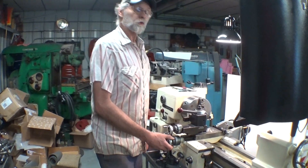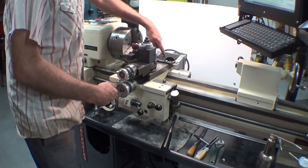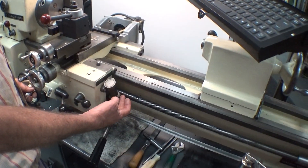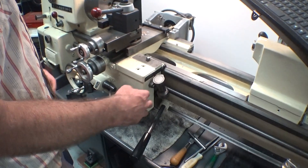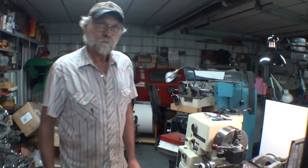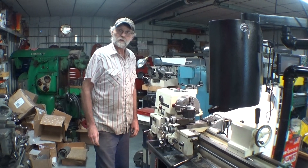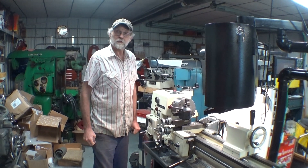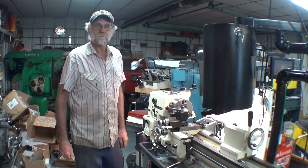When the motors are turned off, the X axis can easily be turned by hand because it's hooked right to the motor and it's a one-to-one drive. Here on the Z, since it goes through the lead screw, we can't turn that directly — that's why I have to drop the half nuts down so that I can move the carriage. So that about does it. Hope you have a little insight on my project here, and if you ever decide to convert your Clausing 5900 lathe to a CNC, look me up and I'll give you some advice. Talk to you later.